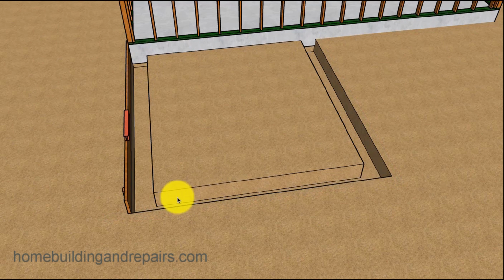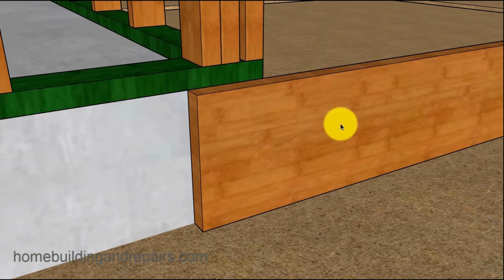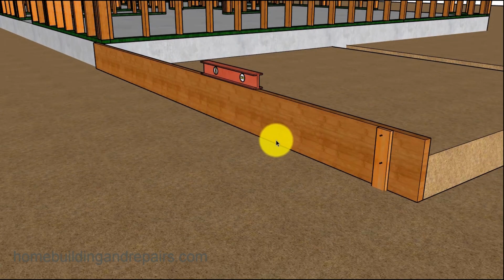After the footings are dug, you can start setting the forms. And again, you can do this, and you can start from over here. You can start from in here. I'm just starting from this side and then going to work my way around. And I usually let the form board go a little past over here. You can have it stop right here if you want, but this prevents the concrete from spilling out if that was ever going to happen. Gives you a little additional support there.